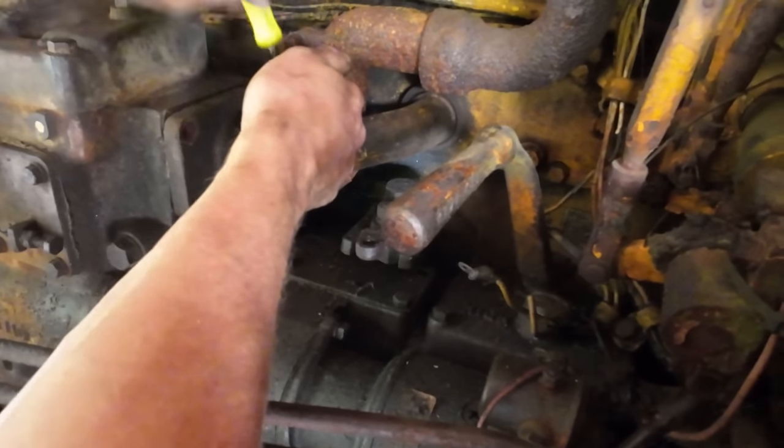Alrighty, now the fun part. I believe there are only two bolts down here left holding this thing in. So we need to support this weight before we go undoing those bolts. Otherwise, we could damage something up here in the output shaft area. So we got a belt slung around the pony, which was fun feeding down there.